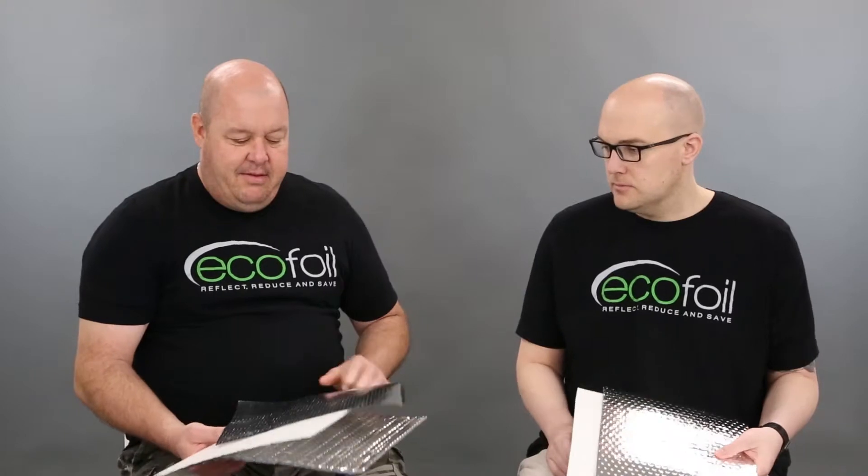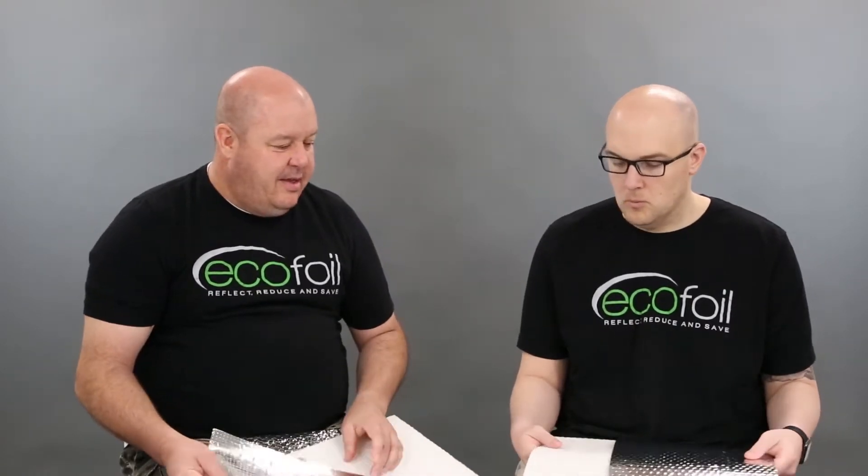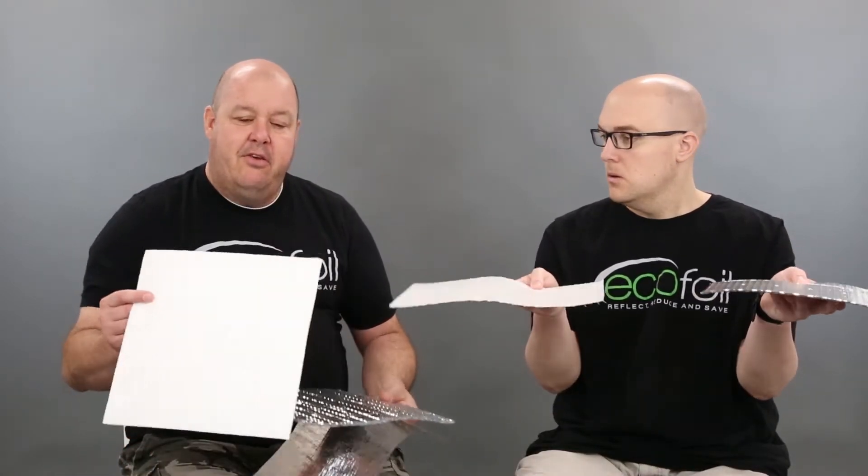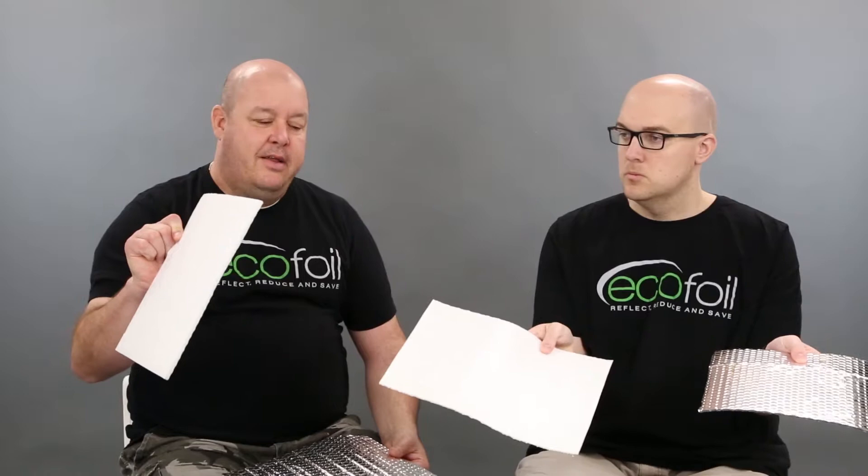When we're talking about thickness and thermal break: here's our standard radiant barrier product, which is just a 5 mil, so you can see how condensation would just occur when it's touching. Then single bubble — which Austin's got here — that's just your eighth inch thick. And here's double bubble, a quarter inch thick. All that's really doing is providing a little bigger air chamber to keep that condensation away. We can also offer it in foil-white or foil-foil, so you can imagine putting this on the inside of a pole barn — how nice and finished it would look.